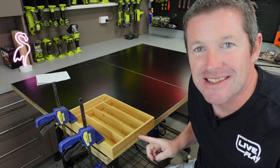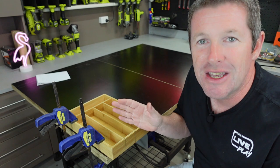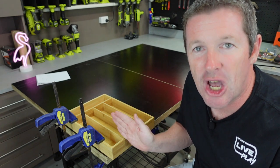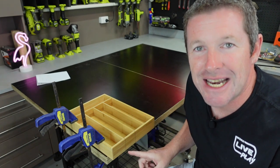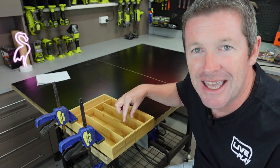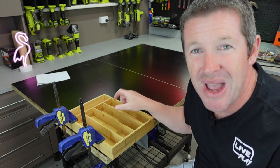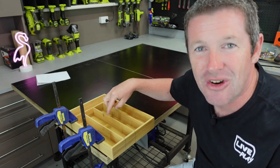to actually cut this section out. And I'm doing that instead of using a power tool so that I can get a nice, slow, easy cut and retain as much material as possible. But I've also done one other thing to help keep the width of this the same so that we can reuse it further up without having any nasty gaps to try to fill in.